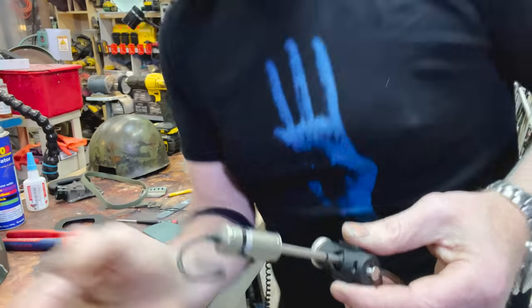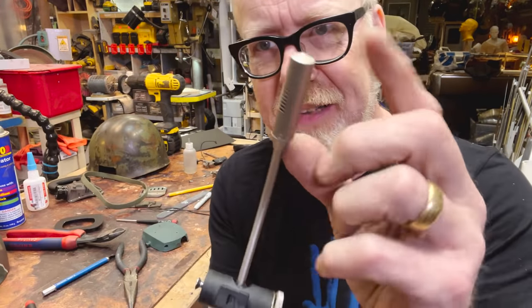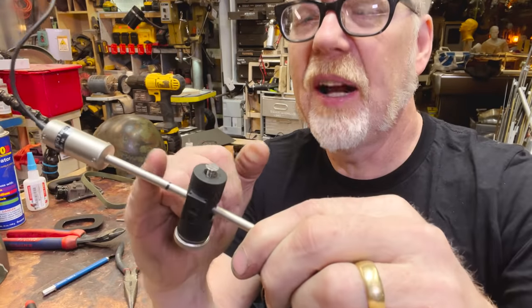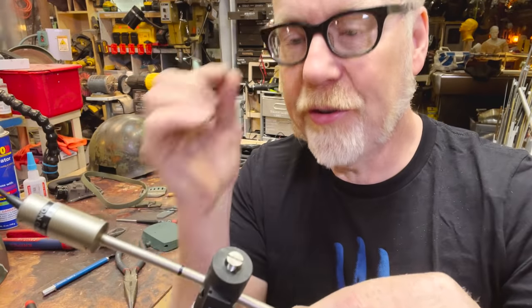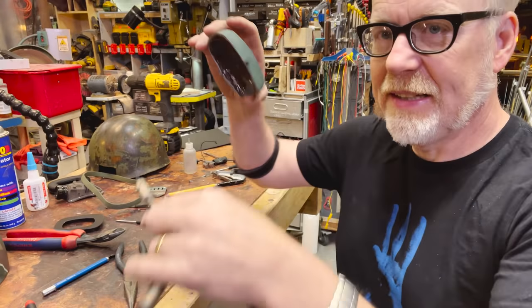Okay, I have pulled apart this microphone. It's a lovely little ribbon element. And this is simply a brass tube, so I'm going to cut it here. I'm going to put in a filler brass tube that joins these two, and I'm going to join it in this thing.